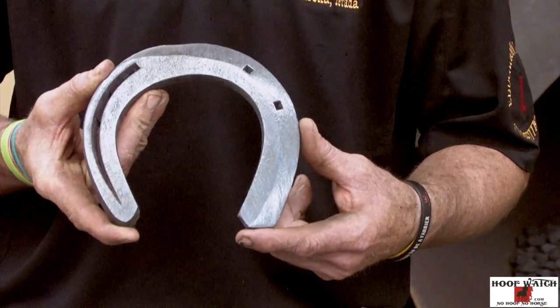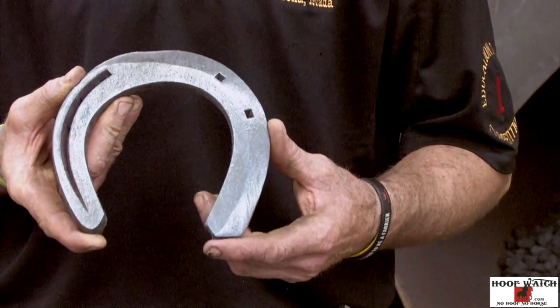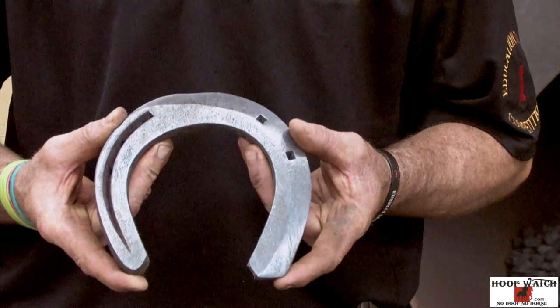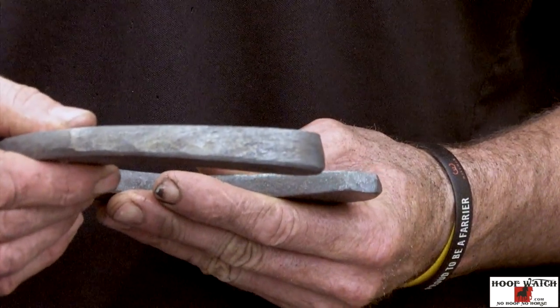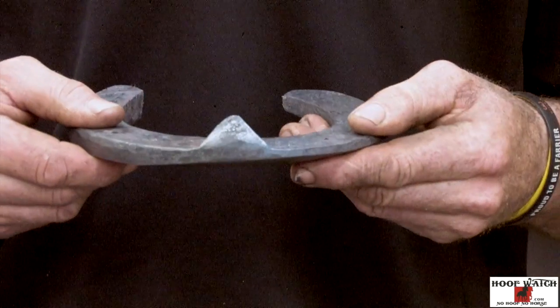The reverse heel check is so that you can have some width without adding a bunch of length. You can grab the buttress of the heel and still have some width. And then it's got a medial lift or running wedge, so it would be considered somewhat of a spiral shoe. And it has a Massalot toe clip.